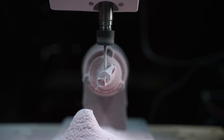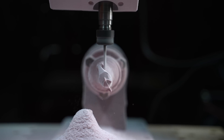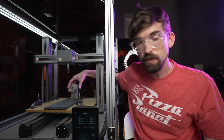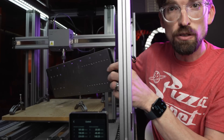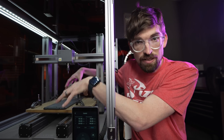The rotary will still have the same issues as the CNC in general — you're not going to be able to run it at high speeds or with a lot of torque, because even with the rotary sitting on top of it, the whole work bed can still flex. That said, the rotary is nice because it attaches in several different screw holes, so it's rock steady against the actual work bed.